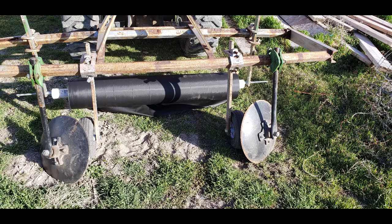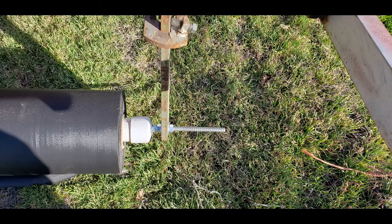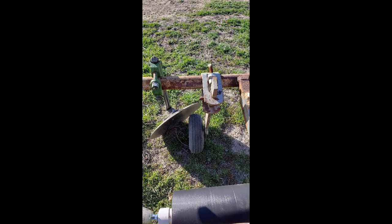I took off the steel wheels and used wheelbarrow tires. And then for laying the plastic, I inverted the plows — they had half-inch holes in them. So I bought a half-inch piece of threaded steel rod from the hardware store and was able to feed that through. It's four-foot wide plastic. I was able to run the PVC through the center of the plastic. It was two and three quarters, so I just got two-inch PVC with some end caps. I drilled out the end caps, put in a bearing but it didn't really hold so it didn't need it. I didn't even need to glue on the end caps — just drill out the center of the end caps, slap it on there, run the rod through it, use some nuts and washers.